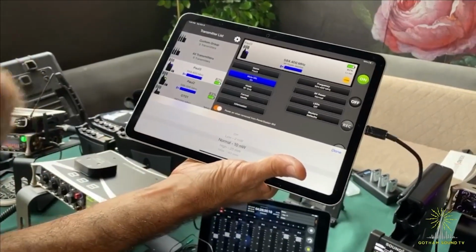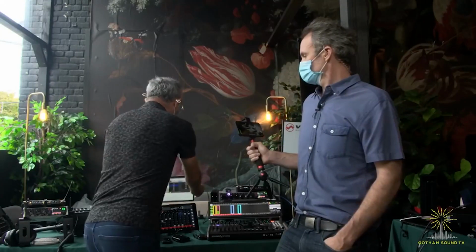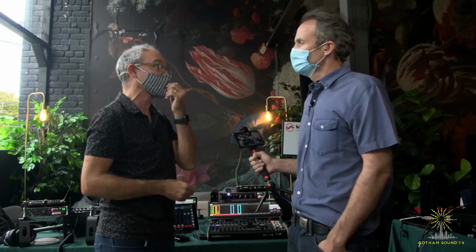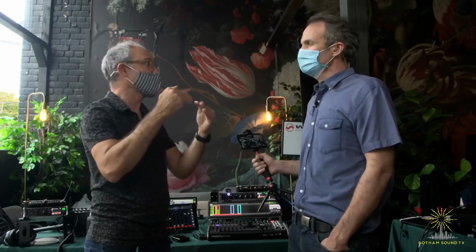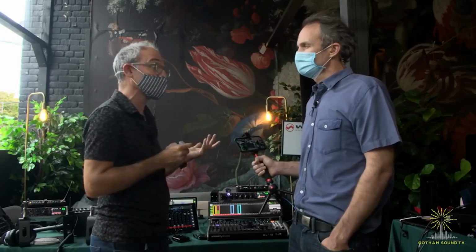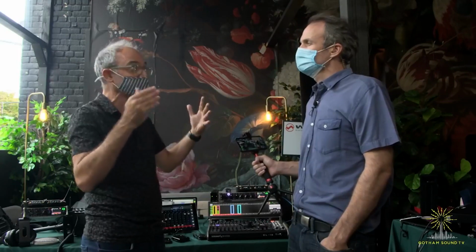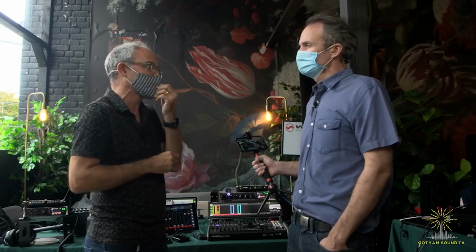Now, obviously, with digital transmission, our codec, you get really good range out of just 10 milliwatts. That's going to handle 90% of applications. The range is really, really good. So you don't need to use the higher power modes in most circumstances. Yes, you still have 20 milliwatts if you need to push it that little bit further, or if there's a lot of obstacles in the way, yes, you can use that. 40 milliwatts, yes, you'll get a little bit extra again.